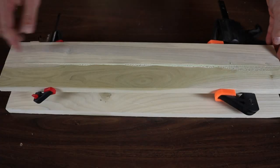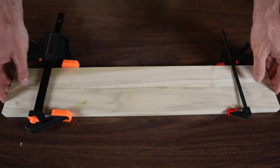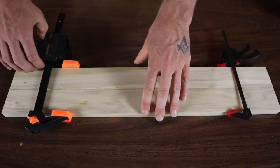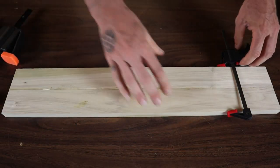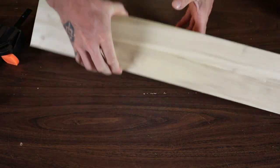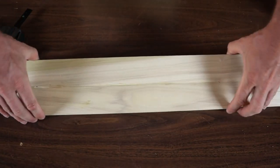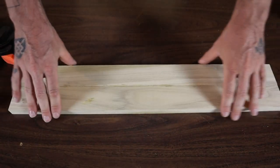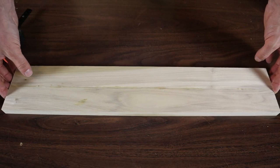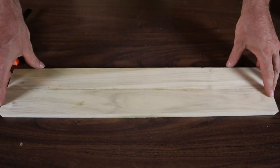Leave it for about 15 minutes and then the glue will start to gum up and you can scrape it off with a razor blade, putty knife, or chisel. You can also wipe the glue off with a wet rag. After one to two hours with a good wood glue you can remove your clamps and move on with the project, but it takes a full 24 hours to totally set. We basically took two short narrow boards and now we've got a nice wide plank. It's really easy and simple — a lot of people are scared of gluing boards but it really raises the horizons of what you can do.